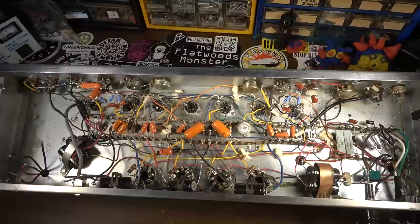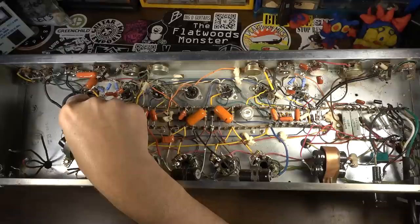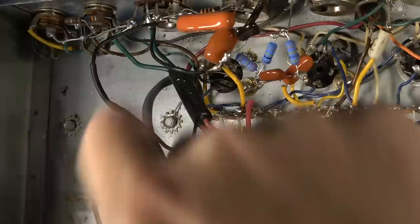We'll design some kind of circuit that uses bass, treble, and mid-range, and a volume control. We'll just completely redesign that whole part of the circuit. This looks like it is a roach for his tremolo right here. So this has a light dependent resistor setup that it uses for the tremolo. We'll look at the schematic for it first of all. Let's just go ahead and dig up a schematic.